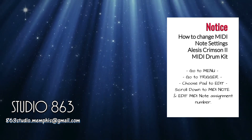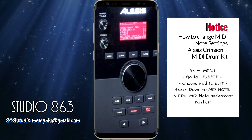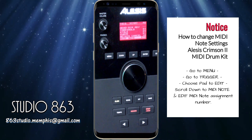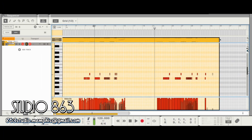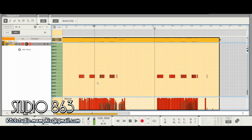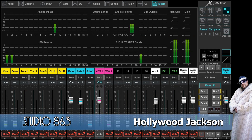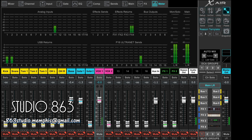I've been in touch with Alesis tech support and they couldn't tell me anything, but we're going in the right direction because it actually works now — we just don't have hi-hat closed when the pedal is all the way down, though it is triggering. In the sequencer, this is set to key edit but you can switch to drum edit and it shows the numbers. If you scroll down to channel number eight, there's your closed hi-hat. It's not a hardware problem with the kit — the actual problem is the firmware does not have a setting for your sound assignment to the hi-hat closed position.